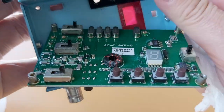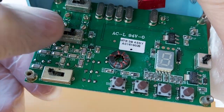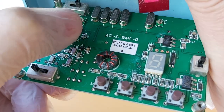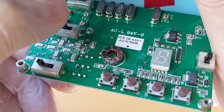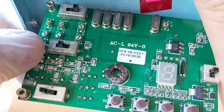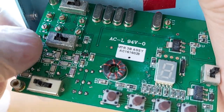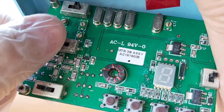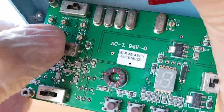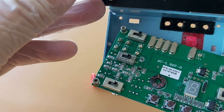The switches and buttons do take a beating in that case and they do oxidize, which causes problems. I can feel the switch is harder than it used to be, and that's not a good sign. I will not put conformal on the switches because if I need to replace them I need to be able to do that easily. On the Weber MTR that's not too hard, but on some other radios they might not be easy to reach. I should really order some spare switches.